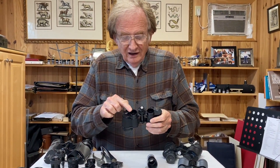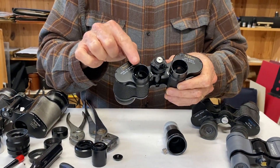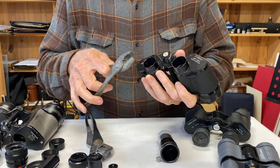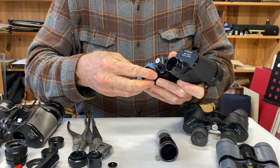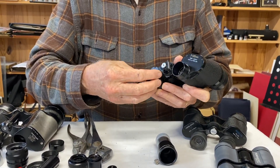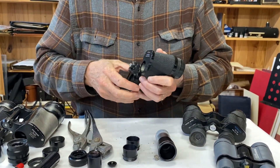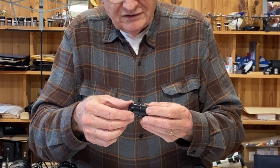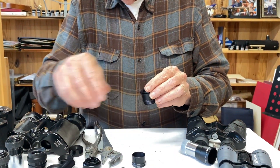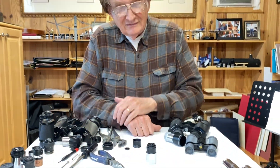We're back here, and you can see that the eyepieces were sliding up and down on these two cylindrical fittings — I call them focuser cylinders. The two cylinders will come out. Usually they're not fastened in very closely, and usually they'll need to be cleaned the same way as we cleaned the eyepiece. Once we've got the eyepiece and the focus cylinders, we don't need the binoculars anymore. We'll put the eyepiece back in the focus cylinder like that, take a section of one and a quarter inch tubing, epoxy that together, and it's ready to go in the telescope.